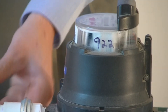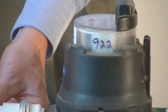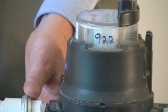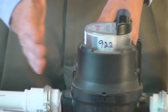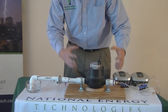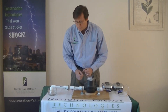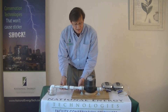As soon as we go to put our new segment of pipe on — if you can focus on that meter — you're going to notice it stops spinning immediately. Now if I pull it back, you can hear a little pressure and the meter begins to spin again. Let me put it back on. What's happening here is the spring in our valve is pushing gently back this way against air only. The municipal water is pushing hard from this side. So right in here we're going to compress the air, which is easy to do when you think of how much air is put into a scuba tank. So right now the air in here is being compressed. You will see a few bubbles come out the other side, but ultimately our meter is stopped because of this valve.